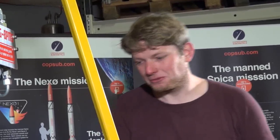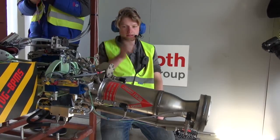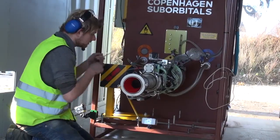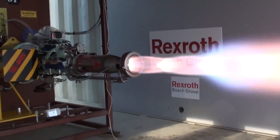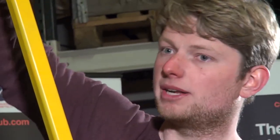After working roughly for three quarters of a year, last October we had quite a nice engine test of this system. It was mounted in the well-known CS test stand, but differently in that I had an additional bearing on top so the entire system was hinged inside the test stand. I then connected a load cell to the side of the gimbal structure, so when we were gimbaling the engine I was able to get a load output of the potential thrust vector deviation, from which I could calculate back the moment of torque around the CG of the rocket.